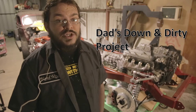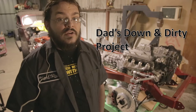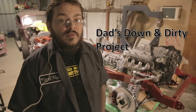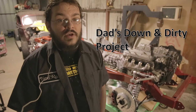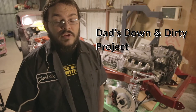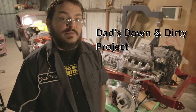If you've got a smaller machine, you'll definitely need to do a little more V-grooving and grinding, and you'll want to do some test parts beforehand. Everything is either 11 gauge or quarter wall. Some of the bigger heavy plates are the quarter wall stuff; the thinner plates are all 11 gauge. Set it up with your MIG welder, do some welds, cut them in half, and see how much penetration you've got.